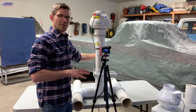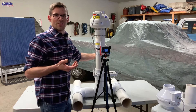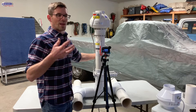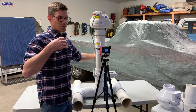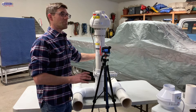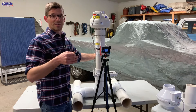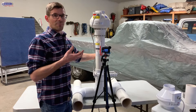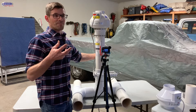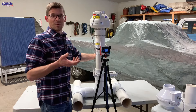So this allows us to dial everything in. You might look at that and say, big deal, you saved 30 watts. But remember that conditioned air loss is usually the largest component of the radon system operating cost. What I mean by that is, say you've got block tops on a house with drain tile that aren't sealed, or it's a finished basement you can't get at to seal it. Say that system's moving 80 CFM — well, half that air or more might be coming from your home, and if you're pulling 40 CFM from the house there's an energy penalty to that, and it can be substantial at times.